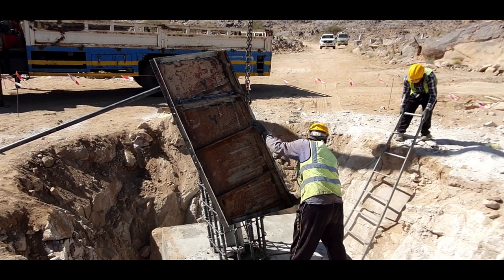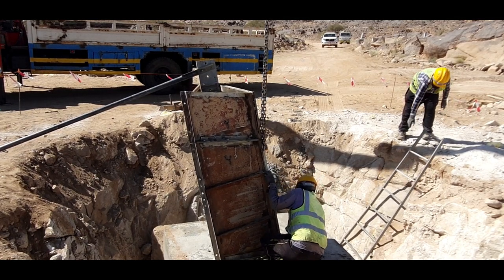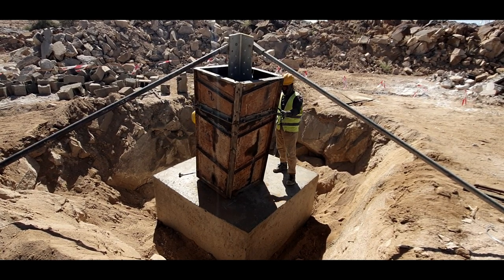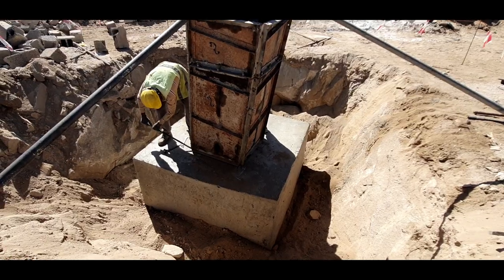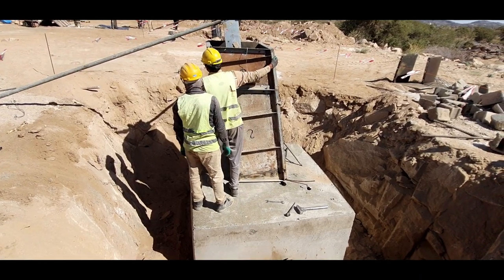Once the footing is completed, chimney form box work is done. Proper support and spacers are fixed to withstand the concrete load after pouring. Stub slope, flange distance, back to back and half diagonal need to be checked once again before pouring. Ensure that the earth strip and copper clad wire are connected to the stub and reinforcement before pouring.